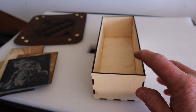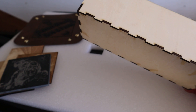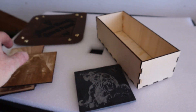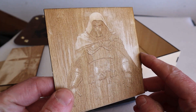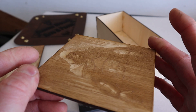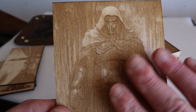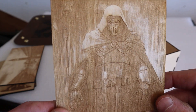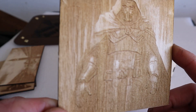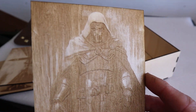That covers a lot of the basic tests I usually do, and it did exactly as I would expect. It's a pretty powerful laser — it cut really fast, which is always a benefit. The one item to be aware of is the engraving: not that it doesn't engrave well, but it's so powerful that it will remove a lot more material than you might expect. I might have to do an additional test where I do a borax wash to get those darker values that you really want to show up. But the image is there, it's clear, and does have the detail. It just doesn't have the darkening that you might expect — similar to what you might see on a CO2 laser, actually.